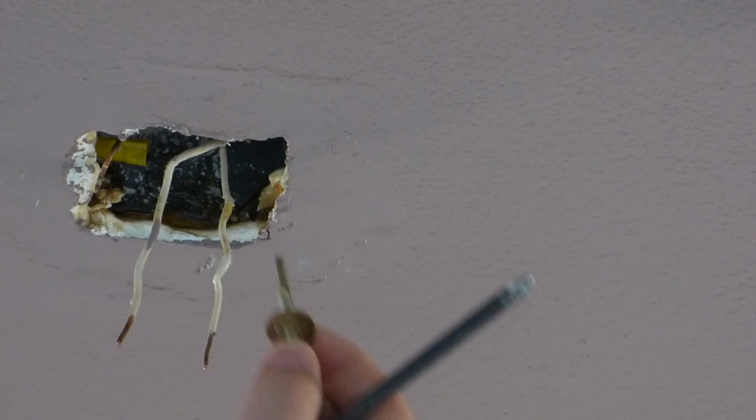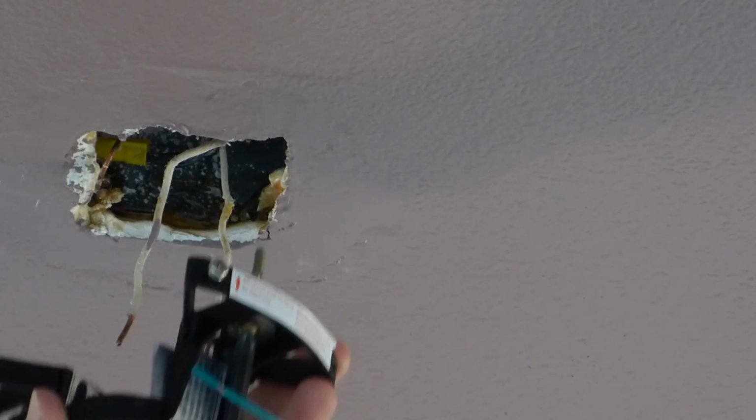We say just use the screws provided with your outlet box. That's what we have, something like that, see? So there's a groove down the bottom, goes up through there. The padding on the other side here is to go up against the ceiling, and just simply drive it home, keeping these wires here in the middle.